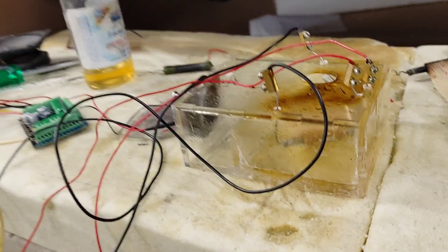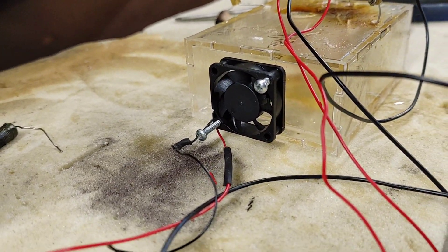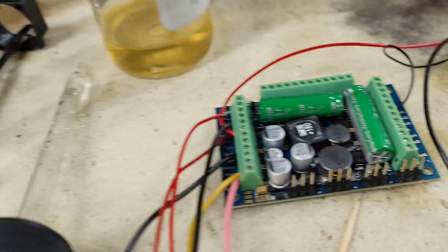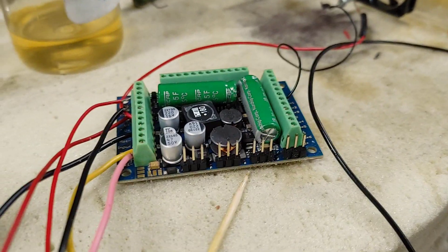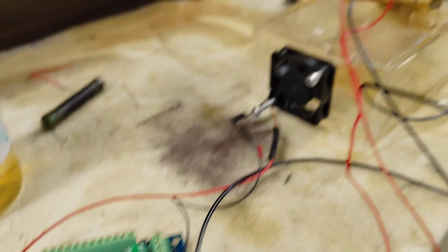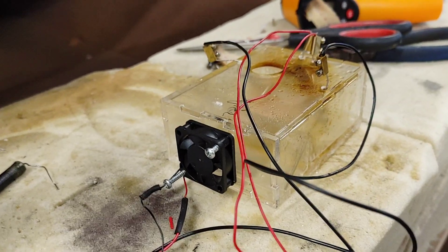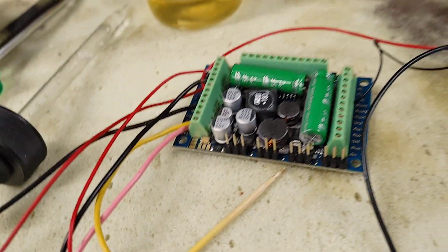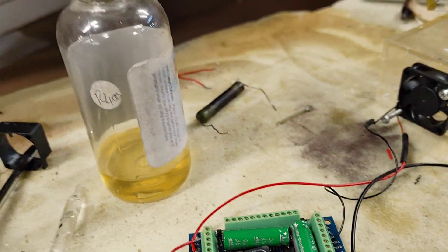And then also your fan — that's a 24-volt jobby. At 12 volts from the decoder it just goes poof. A 5-volt goes poof. And then there's actual smoke — it's lovely. Everything smokes: your fan smokes, your smoker smokes, and after a while your decoder will also smoke. And you'll just put a little chimney in.